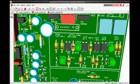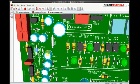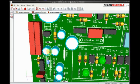And the voltage, well, it's no longer a doubler or a tripler, it's actually 6 times. So we're expecting probably around 120 volts on this, but it's very low current. Because of that, this is mainly going to provide the voltage for testing. It's mainly going to be like a basic voltage to keep the circuit running.